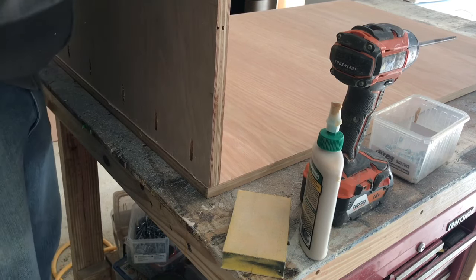I got it laid on the side so you can see the bottom. I've countersunk and screwed these screws into the uprights — there are two uprights. Then you can see the pocket hole from before. This is going to be the bottom, that's going to be the top. I'll put a top on it and those countersunk holes won't mess with the top. So I've got the first bay done with the cleats. The baskets are sliding in and out, spaced evenly — about two and three eighths inch between shelves, then just a one inch gap between the top and the bottom.